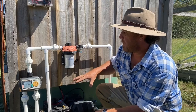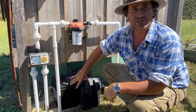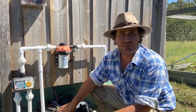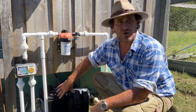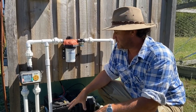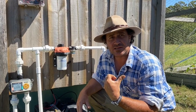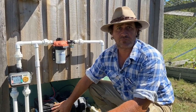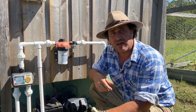Just as a little recap — I run a 12 volt system with deep cycle batteries. You can see two down here. Murphy's Law — my old deep cycle battery finally gave up the ghost, but I've kept some spares from the solar unit at the homestead. These are two six volt systems, around about 200 amp hours. The solar panel charges these, and what I'm finding is I can get around about five days with no sun on the 200 amp system — perfect for those dry winter days.